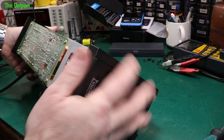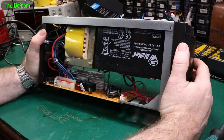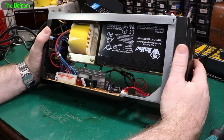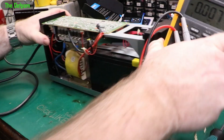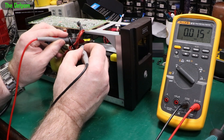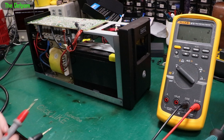There are some capacitors in here but not really big ones. While we're looking at this, we'll inspect the capacitors and see if they appear bad. No signs of bulging — they all look fine. They usually look okay so I'm not even going to worry about those. So let's check this battery and see what it's actually doing. 10.8 volts. Yeah, that battery's knackered.